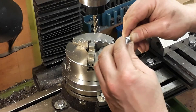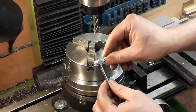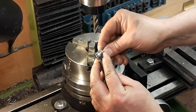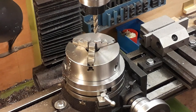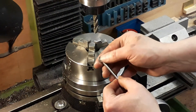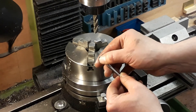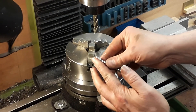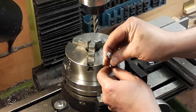You can see it there — nice finish, nice radius on the face at the end. There it is — you can just see the nice little boss we've just left there, so it just runs round on the crank web on that instead of the whole face.